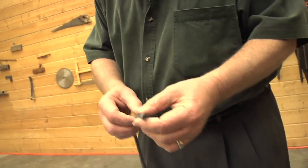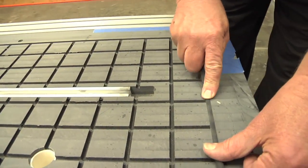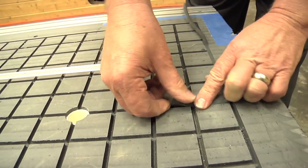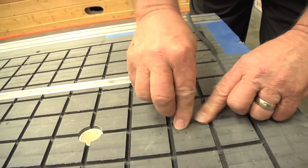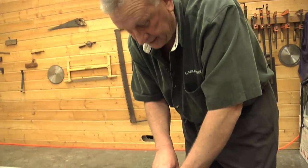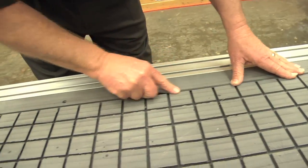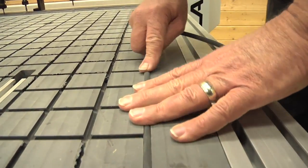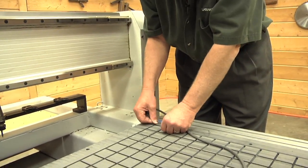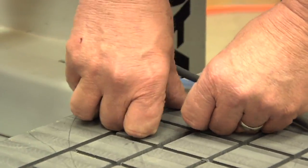This is a closed-cell neoprene gasket, and it's a little bit fatter than the grooves. So we're going to start it out, stretch it slightly, and work it down into that groove. I left a tag end on here with a little extra piece in case I come up short and need some extra length. When you get to the corners, be very careful — you don't want to stretch it because it may shrink on you. Make sure you have plenty of material in the corner. If you pull it too tight, it may pop out, and you'll find your gasket isn't nearly as long as you thought it was.